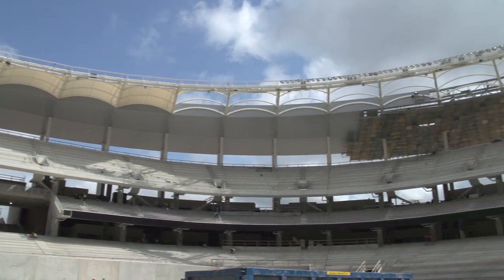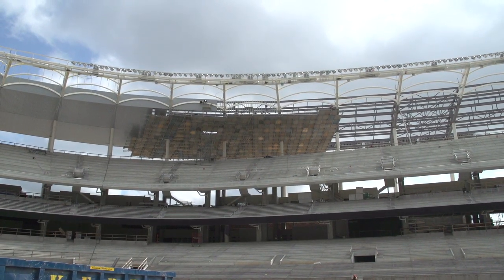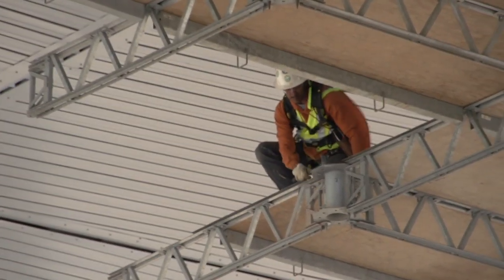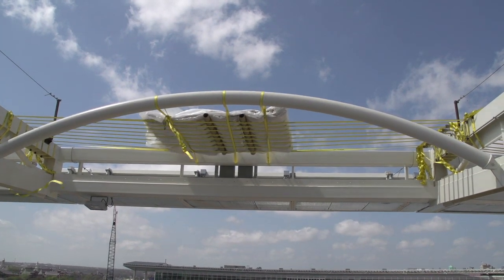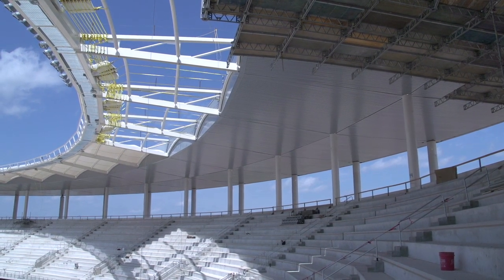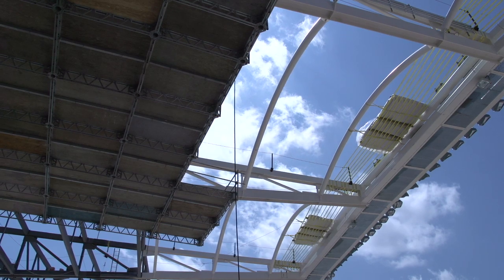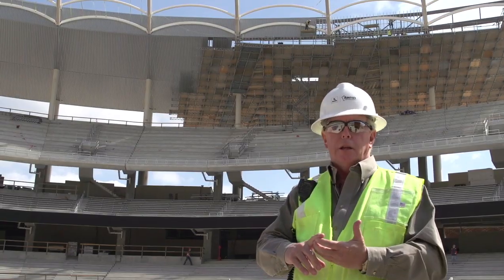As you can see behind me, they're in the operation of moving the quick deck clockwise around the grid lines — they're swinging it out and tearing it apart. Following the quick deck is the canopy fabric falling around it. That's done up off the top of the steel — that's the only thing being installed from the steel. All the rest is being installed off the quick deck: the soffit paneling, the electrical, the plumbing, the painting — all work up there is coming off this quick deck.